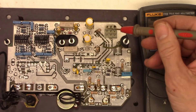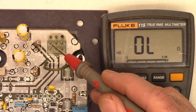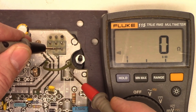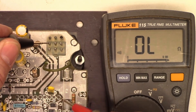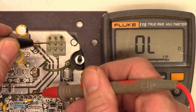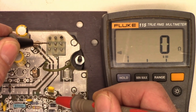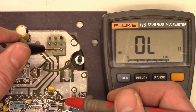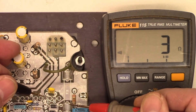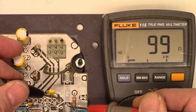Let's do some basic checks. I see where the power plug comes in here. There are connections labeled: speaker negative, speaker positive, V minus, and V plus. If I measure from V plus to one side of the fuse, I get zero. V minus should go over here. There's an integrated power module, a hybrid power pack chip. Pin 6 reads continuity to the negative input of the power supply. This is the positive side - goes to the fuse. Reading from the other side of the fuse: 3 ohms to pin 7, 0 ohms to pin 8, 99 ohms to pin 10.